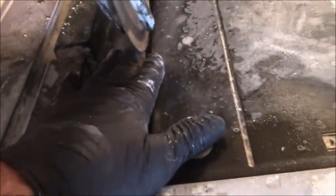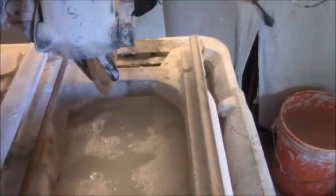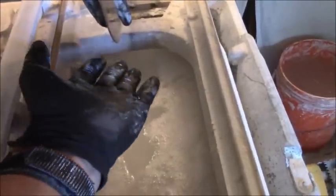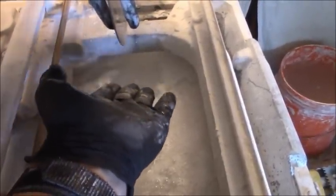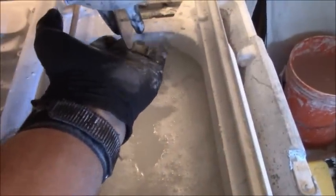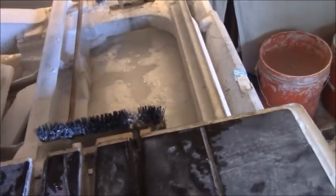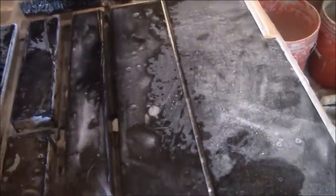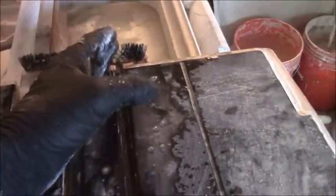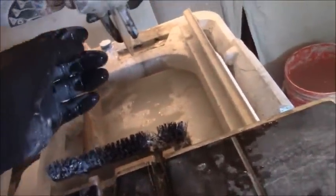If I want to do a plunge cut, I set my tile under it, pull down on the handle until I want the cut made, then turn it for the next line. There's enough room on the back so removing the table isn't an issue anymore — I can turn the tile upside down for a back cut. The table goes way back so you can do a 24-inch tile with room left over to push it through, and you can set a full 24-inch diagonal tile on here without anything coming off the table, which is absolutely wonderful.